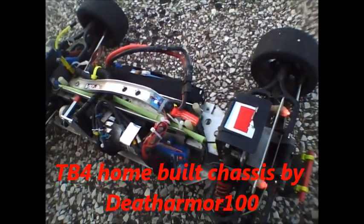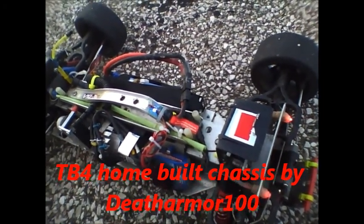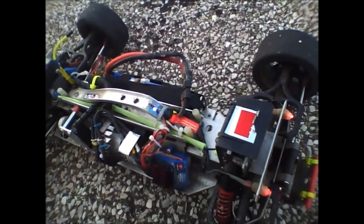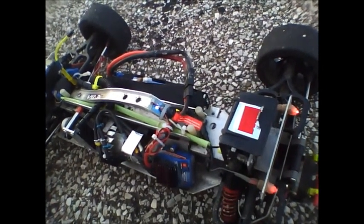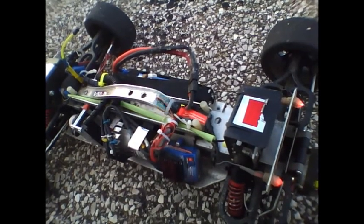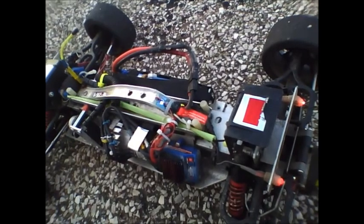This is DeathArm. Today I'm testing out the Hobby King Low Voltage Detector for LiPo batteries. This one is for the 11.1V 3-cell battery, or any 3-cell battery. You can tell when it's running low — it'll start out a bright blue, and as you can see it's blinking now. It'll slowly change into another pattern of red and blue blinking, and then an audible tone once it's run down to the limits of the battery capacity.